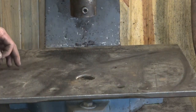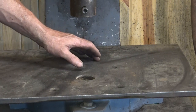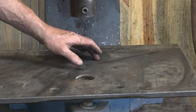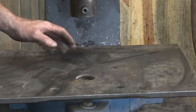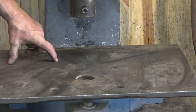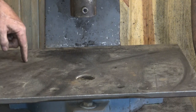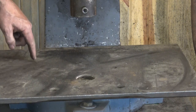So what's my idea? The original base for the fly press has T-slots in it, and that works pretty well. T-slots are way more secure, they're adjustable in and out, and you can put all sorts of different clamps in the T-slots. So I took a can of spray paint and sprayed up under here through the T-slots, and hopefully I can find a nice paint mark where the T-slots are. I'm going to transfer those through my table and have T-slots in the top.